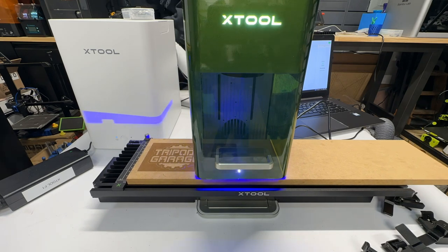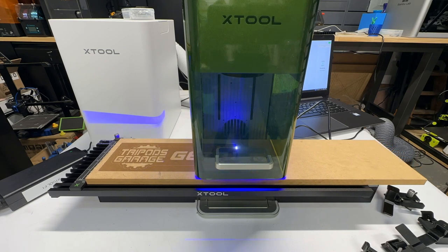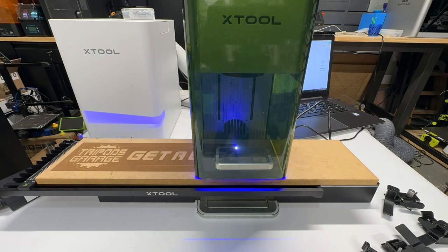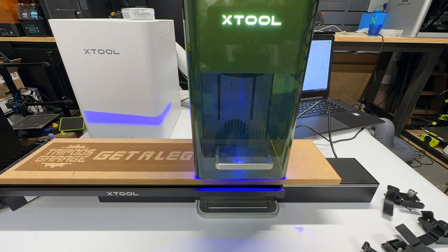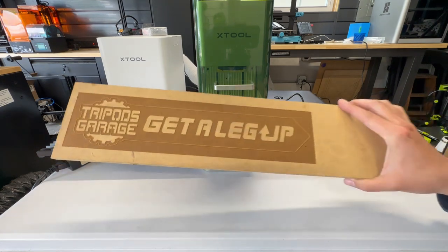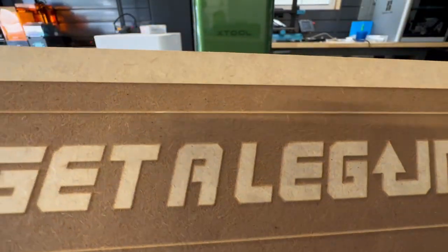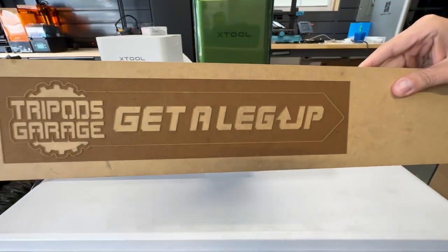I ran with it because that's just what I did. But if you're looking to do a very detailed photo, that's what the DPI setting is for. You can see how nicely the engraving is coming out. It took two hours, but you can do it in a lot less time — just lower that DPI setting, maybe 300 or less. Came out really, really nice.